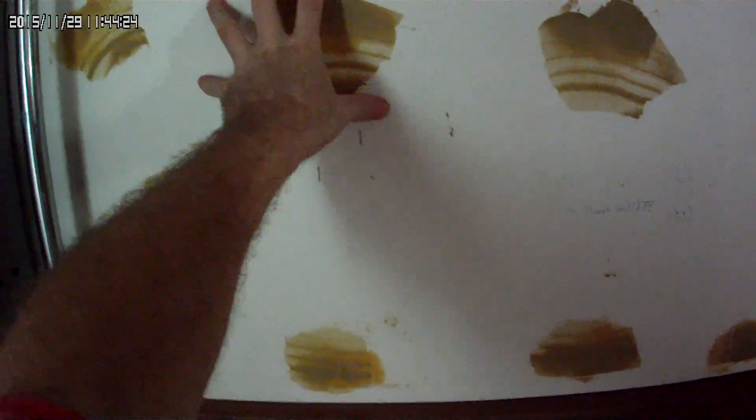My setup here — what I've got is this is the first unit I had made. This is a 12 liter per minute LPG tankless water heater, and I'm going to put this in here. I'm going to put the tap down here because where this beam is, this is the actual deck — above this is the main salon, right behind here is the helm where we drive, and below on the other side is my engine room where I have my two engines.